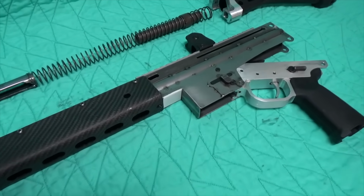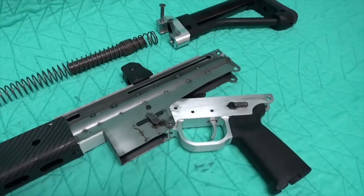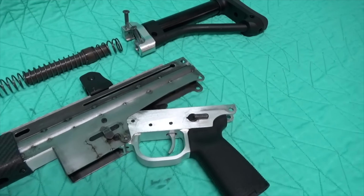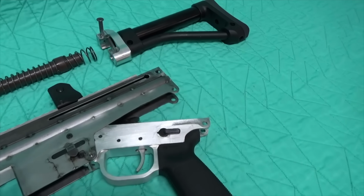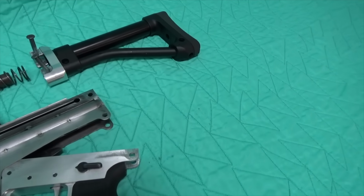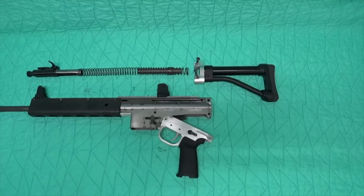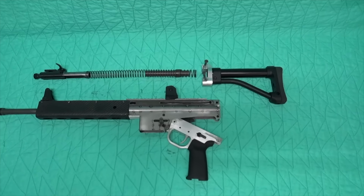Justin had those cut out of 4130 sheet by one of those services you can find all over the internet that does laser cutting. One thing I was very interested in with those parts is the laser cut edges, because as you might know, when you're laser cutting a heat treatable steel, the edges get hard as a frickin' rock. But Justin said he didn't have any trouble reaming those holes that were cut a little bit undersized, obviously.